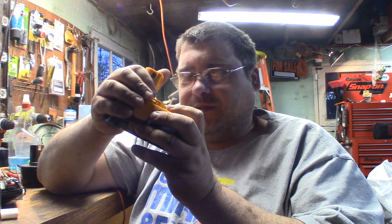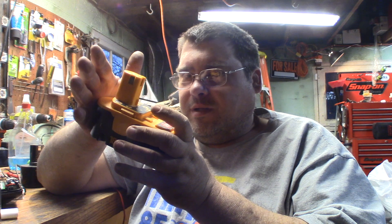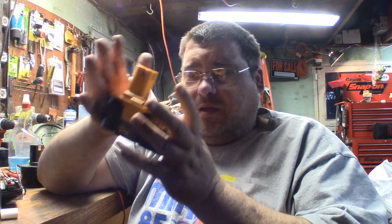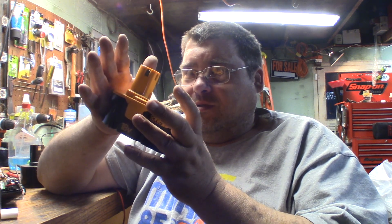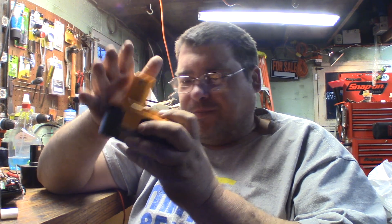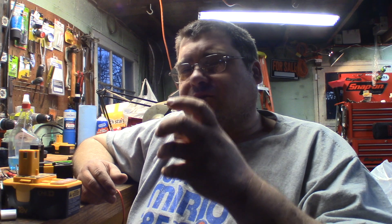It's not a big short — it's still pretty high resistance. That's when you first notice your battery doesn't last as long. It gets a little worse and you notice the battery goes dead on its own after sitting for a while. When it gets really bad, your charger detects a short in the battery and shuts down. What we can do is give the battery a huge surge of current all at once, and those little whisker filaments will just explode and melt away. Then your anode and cathode are separated again — your battery is like new.